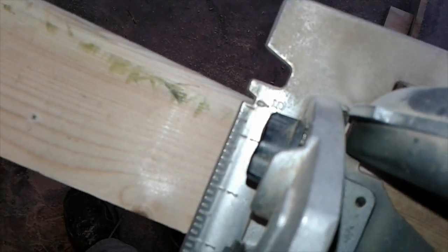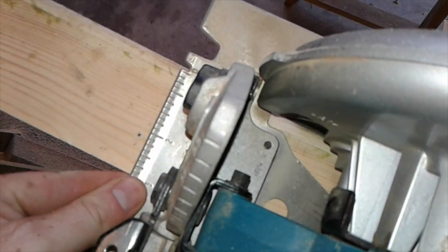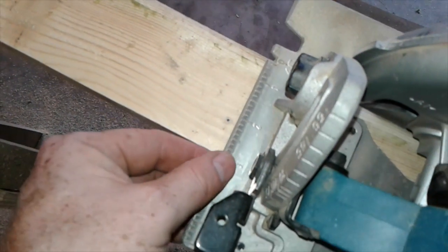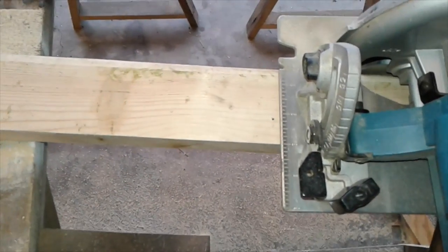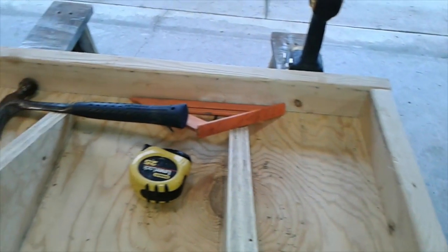The circular saw has a little edge guide. If you're cutting, say, three inches, just set that on there and it'll be sawing at three inches all the way down. I like to hold one finger along the edge of the wood as a guide — keeping it away from the blade — and slowly allow my finger to run right along the edge as I cut. If you have a table saw that's much easier, but this technique works and you won't split the board.